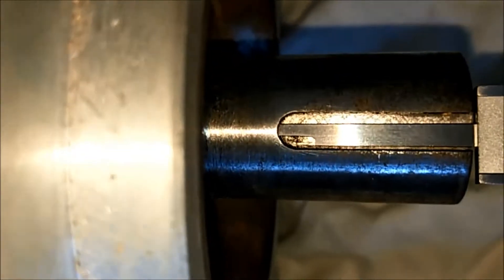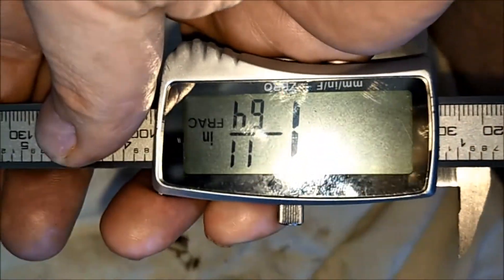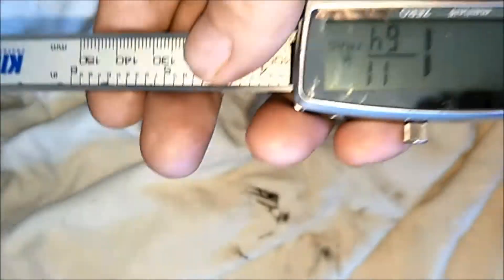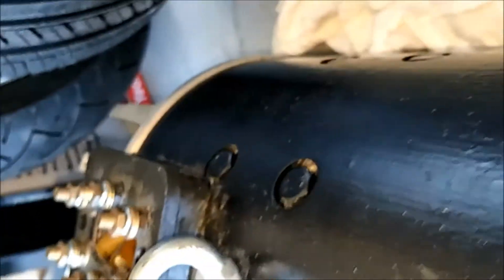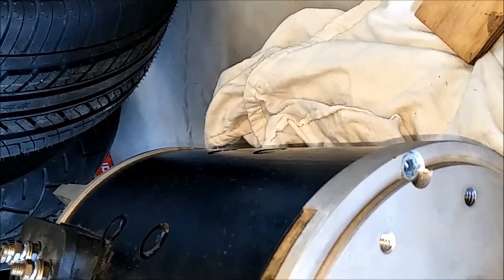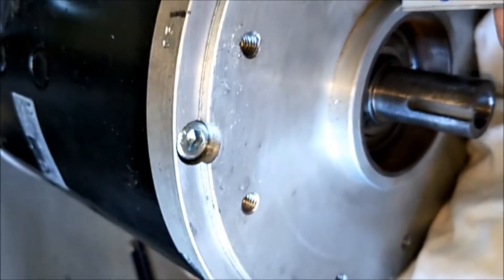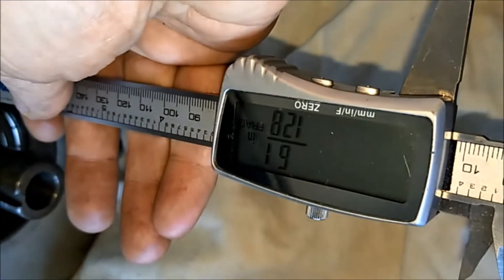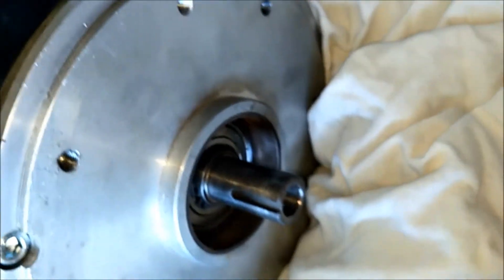To the very back, so to where the curve starts — inch and 11/64. Okay, on this one here, this lip here goes over there, so this face here is the face that's going to touch there. Actually, I didn't take any measurements from there. So if I measure the outside — 61/128. I should be able to hopefully work out those other dimensions from that.